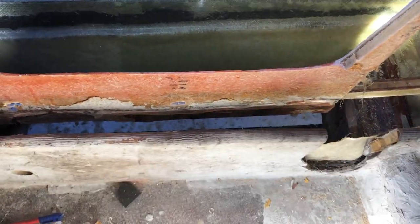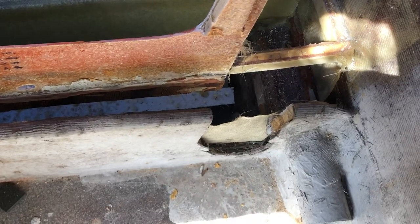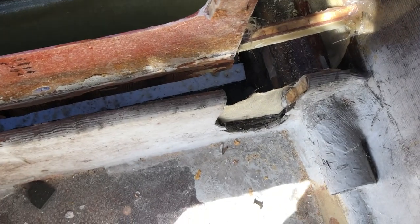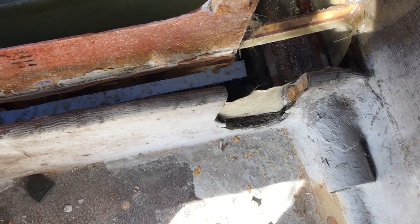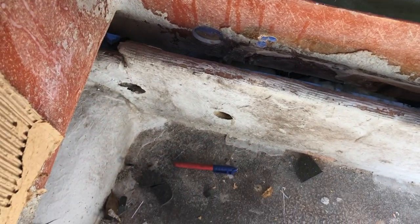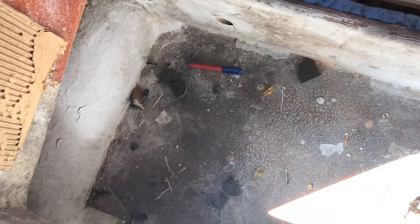And then that way, all this inner stuff, I can seal all this stuff up, and all these holes and everything can be sealed, and this will be a dry hatch area for whatever we're going to put in there. So I still got to cut a little thing for that. I thought the foam was going to go there. That's why I put that little piece of fiberglass in there. I always meant to remove it, but the foam didn't go up that high on either one of them. So I'm going to cut out a piece of honeycomb, bed it in there with thickened epoxy, make that one full piece, fill all those holes in there with some putty, sand all that down, and that way we can re-gel coat this and make it a nice little box.